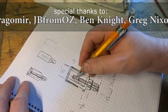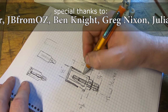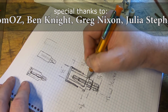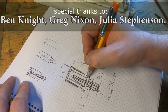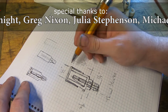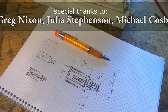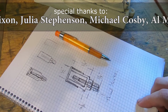We need to find a bit of brass tube, which will be next to go in there. And we can drill this out or machine it out, probably 3/8 or a fraction bigger. If I've got an 11mm end mill, that might be a really good way to do that. And we should have a pretty nice sort of an oiler. So let's get some materials together.